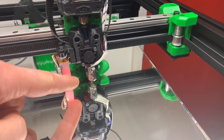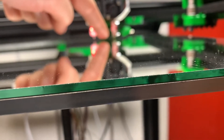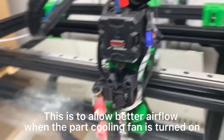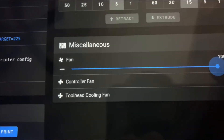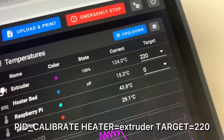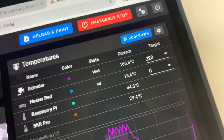So how I solved this problem was I did two things. One was lower the nozzle so it's just about touching the bed, not about a millimeter above the bed. And then I turned on the part cooling fan to 100%. After this, I ran the normal PID autotune to my target temperature. That's what made my PID autotune so much better.